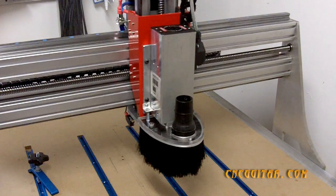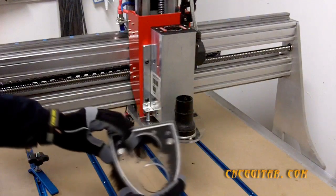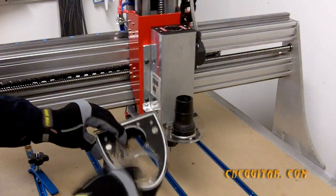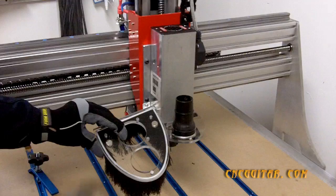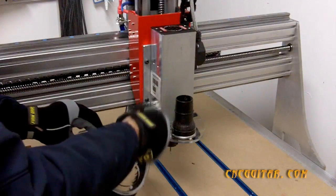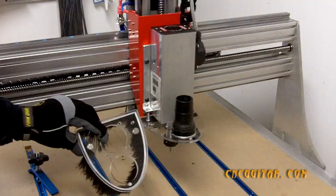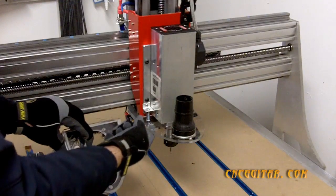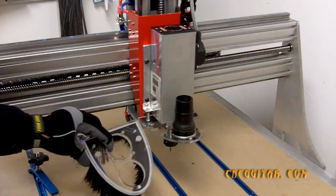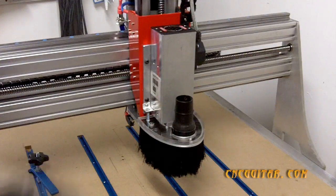I haven't needed that — mine works quite well. The holes here give me adequate clearance for the vacuum extraction as well as clearance for the VFD spindle so nothing grinds. I offset the magnets slightly — putting the magnet maybe 1/16th of an inch deeper on one side and leaving this magnet 1/16th of an inch proud on the other — so when the two parts mate, they automatically align. This lets you easily control the depth, especially if you machine this on your CNC, giving almost a perfect fit every time for the clearance needed around the VFD spindle.